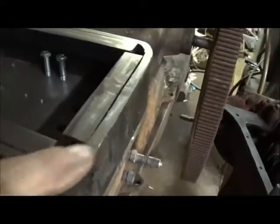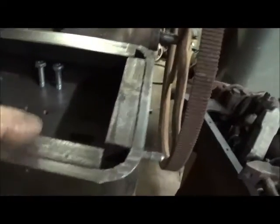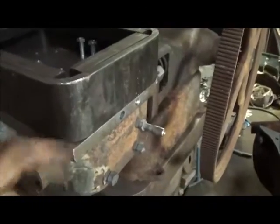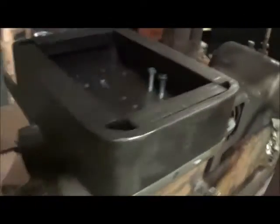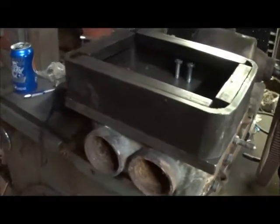We've got the top and bottom machined, so we're done there. You can see the gasket is going to seal around the outside edge, but I needed something to bolt it down to — that's what those are there for. I'm going to grind the bottom here, trim these off, and go ahead and get that welded down on it. We're getting a whole lot closer.